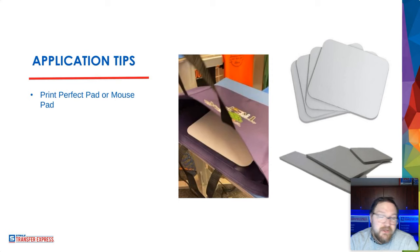There is no guessing, because otherwise you're kind of playing with the paper test or the feel of how it closes, like how the heat press is closing. Oh, that was really easy. And then you have to look: did it close all the way? Is it even making contact? And yeah, sure enough, it is. So it really helps when you have the Hotronix press that's telling you what the pressure readout is, but it's just because the size is so much smaller, it's compensating for that entire surface area.